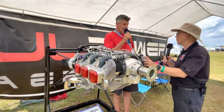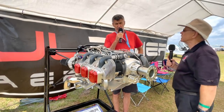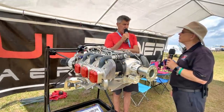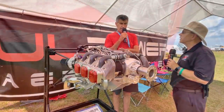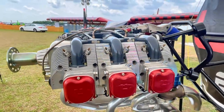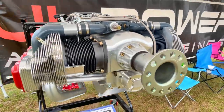You supply all kinds of aircraft but they've all been kit-built so far. In the US, anything that goes in an SLSA has to meet the ASTM standard, and we tell the airplane company our engines meet that standard. This new 220 horsepower engine — the factory in Belgium used it as the first one to comply, so it is built to the ASTM standard. We can now sell an engine with our dual ECU system that meets the ASTM standard.